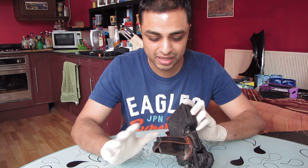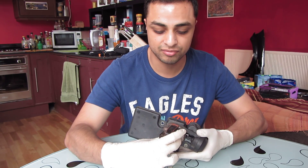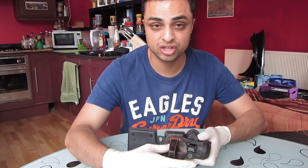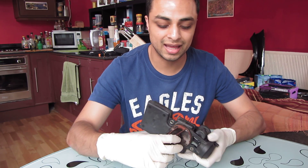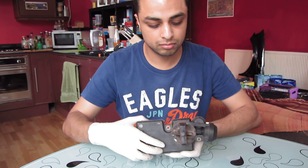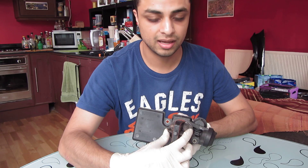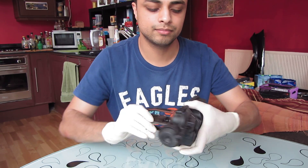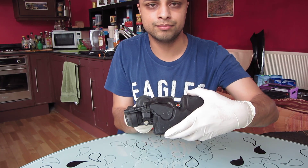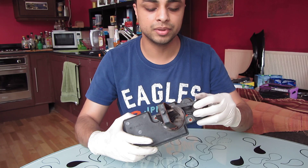As long as those bits are all intact, the next thing to do is just look at the flap itself. When you turn it, does it return to its normal position? That essentially shows that the piston — you should be able to see just here — as I rotate the flap, the piston moves. The piston's moving, opening and closing a little vacuum pump in here.